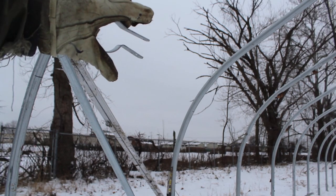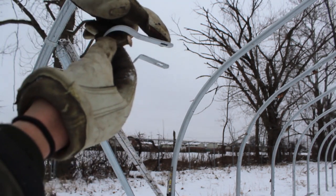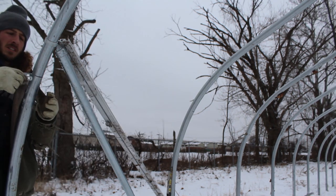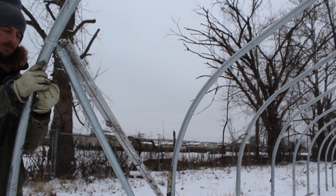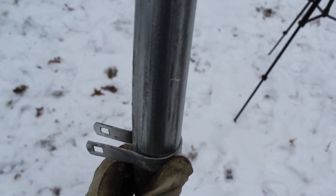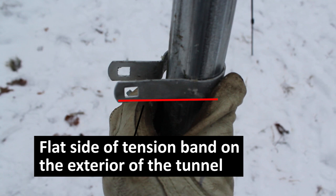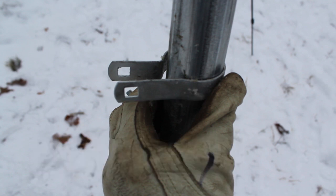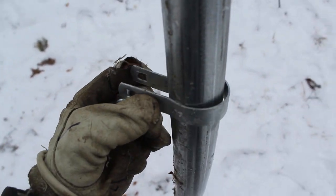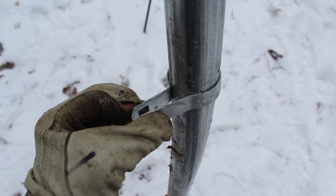To begin, we're going to find our tension band — this is what a tension band looks like. You can see that the tension band has one flat side and the other side is crimped. We're going to push that tension band on our end hoop right near where our hip rail is marked. You can see that the tension band has the flat side on the exterior of the tunnel, and you're going to line that up on the structure itself. Now you're going to have to crimp the end of that tension band with channel locks. This will make it easier to get a bolt through the holes when you're connecting the channel.